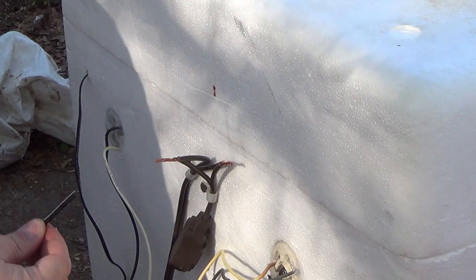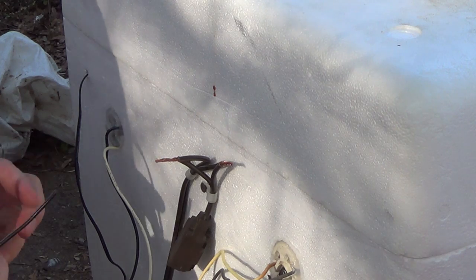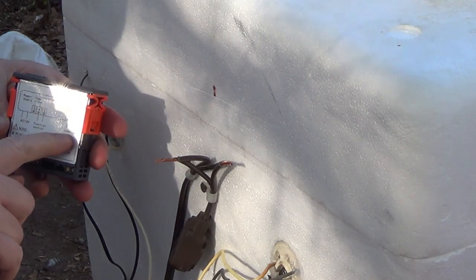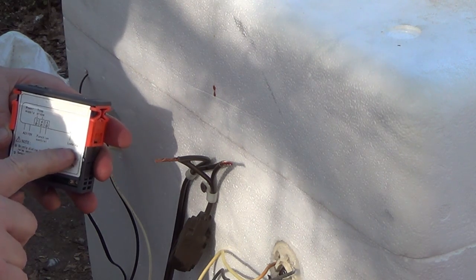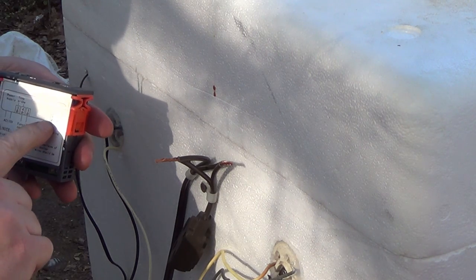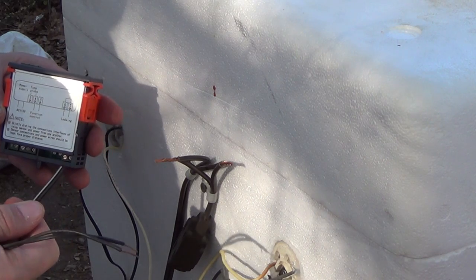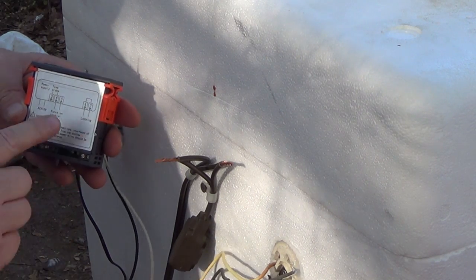This is another set of two wires together. This is going to be a thermostat. Your thermostat interrupt is right here on the loading side, right here on the relay. That's what these two wires are going to be hooked to. They're going to go in one to one side, one to the other, and it doesn't matter how you do it, but that's going to interrupt to go to one side of our bulbs.